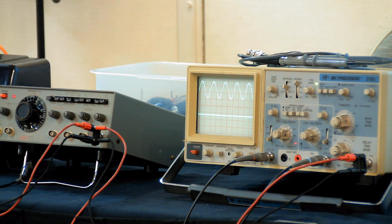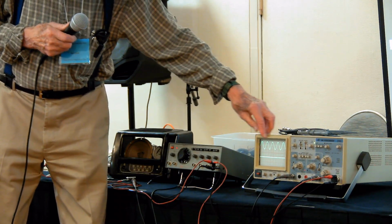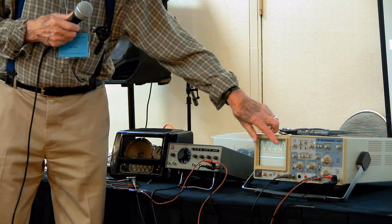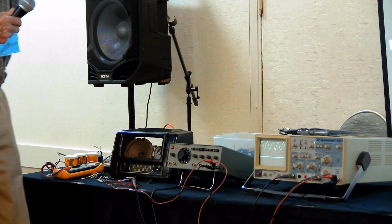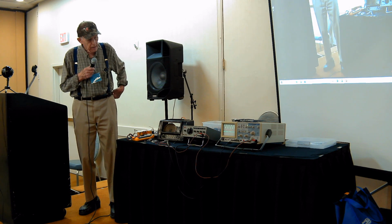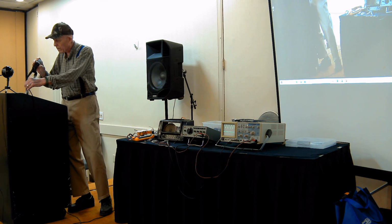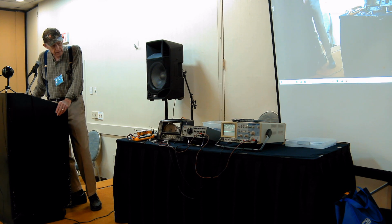So, what was interesting is I changed frequency, and this thing changed in distance between peaks. So this is obviously not reading frequency, it's reading time. And that's the important thing about a scope. The ordinary oscilloscope, the analog type oscilloscopes at the very least, always show you something versus time. And you have to sometimes interpret that in terms of frequency.